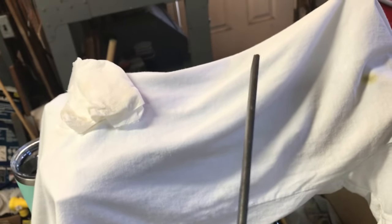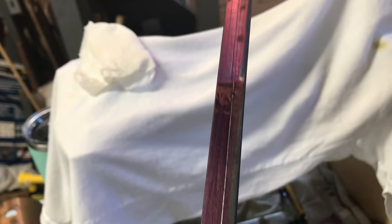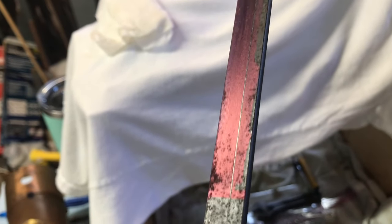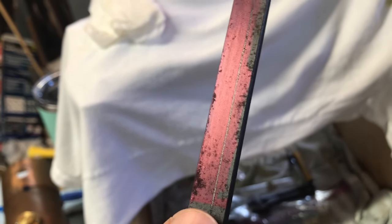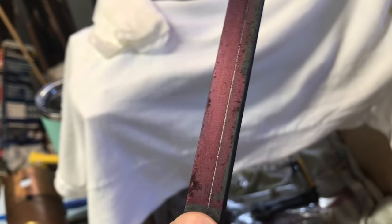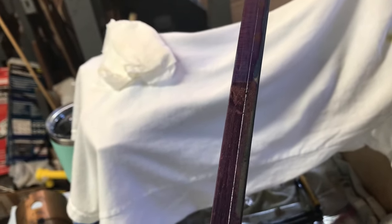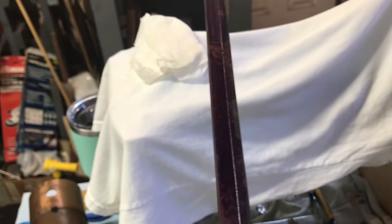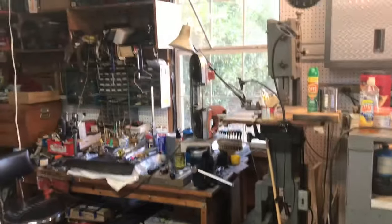And the next task in making the grate is simple. That is cutting 5/16 by 1/8 inch thick steel flat bar for the grate pieces. Since the vise on my milling machine is a 6 inch vise, I'm doing these in about 6 1/2 inch sections at a time. That should be enough for 3 bars, so I'll just have to do several sections of this, but I've marked it out. Now I'll cut it on the bandsaw.